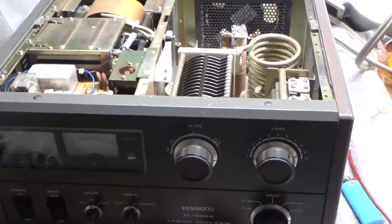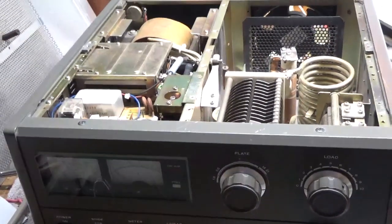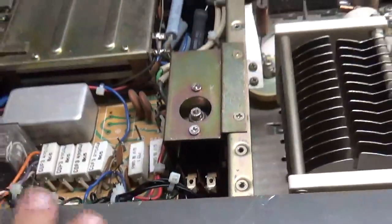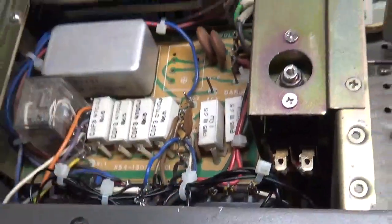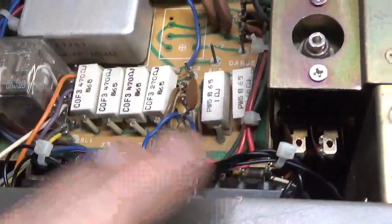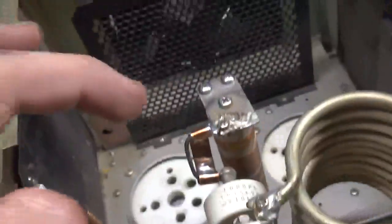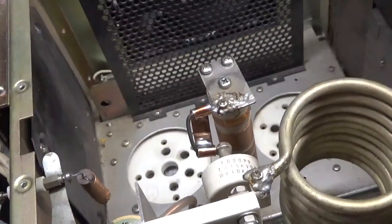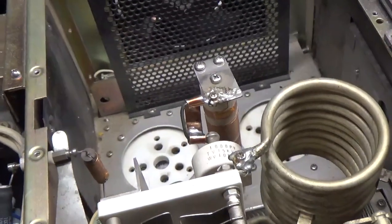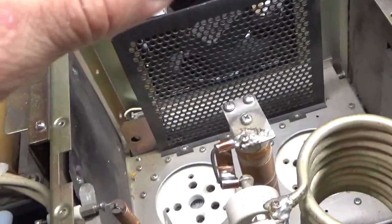I'm back with the completed TL922 amplifier. I'll go over everything I did quickly. I had to replace the meter lamp bulbs — some were out. Some of the wires were all burnt up from someone going in with a soldering iron, very sloppy, burning the insulation on a lot of the wiring. I cleaned all that up, replaced the bad bulbs, zip-tied everything, put the series glitch resistor in, zip-tied the wiring. Put the strap in between the plate choke and the plate blocking cap. I removed the tubes — this got a brand new Penta Labs set of tubes. I got rid of those U-shaped parasitic suppressors, which weren't made right — the resistors had already shown some heating — and I put the stock assemblies back in.